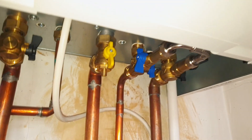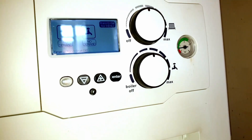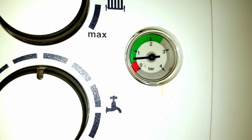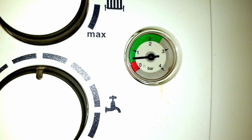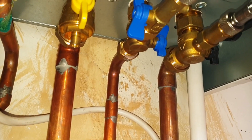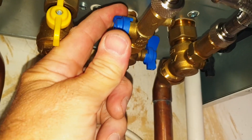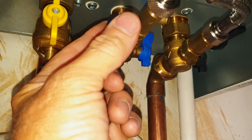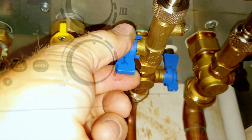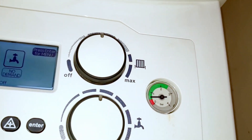You can see I've now closed the valve again and I'm going to go and check what pressure the boiler is at. You can see it hasn't taken very long and the pressure has already risen up. Sometimes it'll take a lot longer to fill up, but you've just got to keep an eye on the gauge and make sure that we don't put too much pressure in it. One way to do it is just to keep your hand on that valve, slowly open it, watch the pressure rise, keeping your hand on the valve so that as the pressure rises you can shut the valve again.